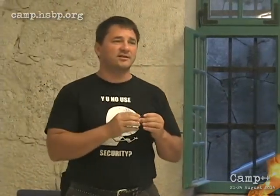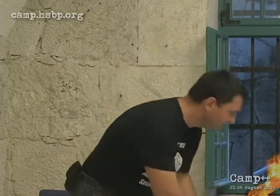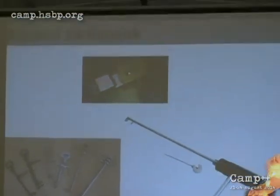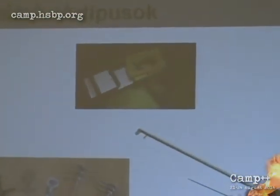Maybe you can say, okay, but how does this lock picking technique work, because it's a completely different structure, different closing elements, and so on. The principle is the same. The accuracy of this lock is as bad as for pin tumbler locks. And if you push the bolt into the opening direction, and this part of the bolt is touching the levers, only one lever is loaded by this touch or by this force.